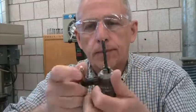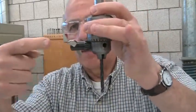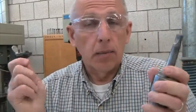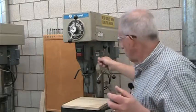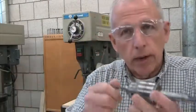One thing you never want to do is leave the chuck key in the chuck. If you were to start the machine without looking, the chuck key is going to go flying in some unknown direction — it's pretty heavy and if it hits you in the face, you're going to get badly hurt. Never leave a chuck key in a chuck on a drill press, lathe, or anything else. Get in the habit: when you tighten the bit, take the chuck key out immediately. We keep ours hanging on a chain so it stays with the drill press. Some chuck keys have a spring-loaded button that always pops them out automatically.